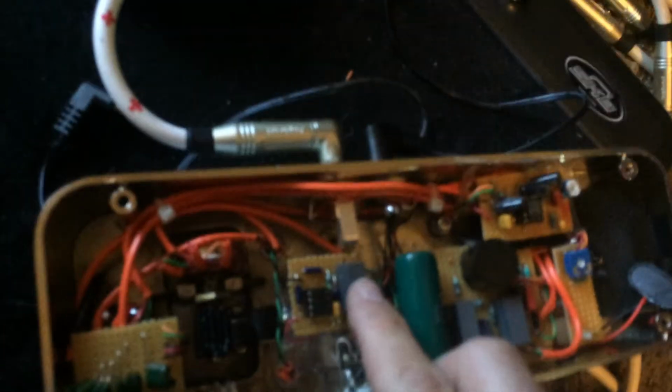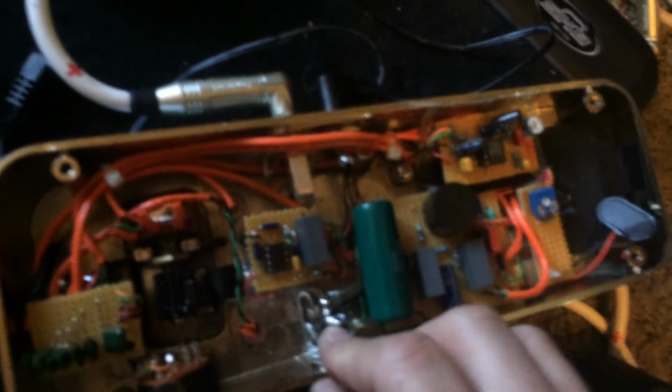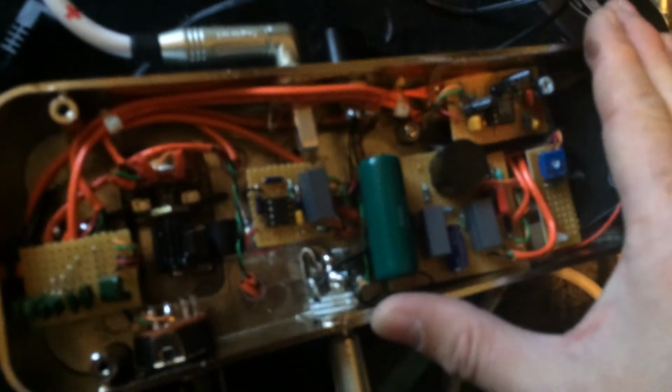But anyways, I did a FET style input buffer, so right off the input going into this guy. I kept it for the bypass because it sounds great again on passive instruments. If you're using an active guitar and you're in a butt rock band or something, just let me know. I can bypass that for the bypass signal if you don't want to have a booster or a buffer at the beginning of your effects chain.